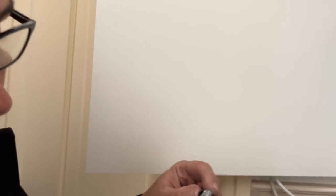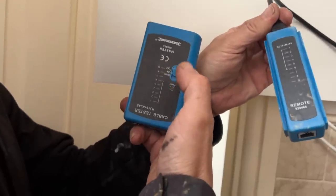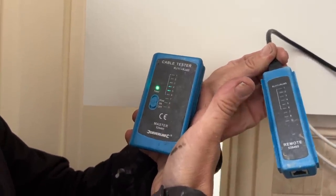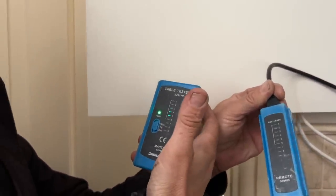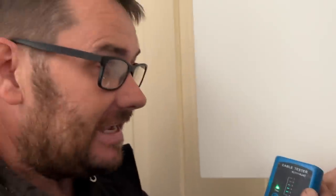Before I go to the garden office I'm going to plug this end of the tester in. When I go to the garden office and put the end on there, I'll plug it in and turn it on. Once I connect it, I should get one, two, three, four, five, six, seven, eight lights. If anything doesn't work, I know I'd have to dig into the modem settings, but with the modems we use they have access point mode and there's pretty much zero chance of failure. Regarding the 60-70 metre cable run - we've done some really big runs. I'll do a speed check in the house and then test when we've put our cable in regardless of the length. Another 60-70 metres properly connected is not going to affect speed.